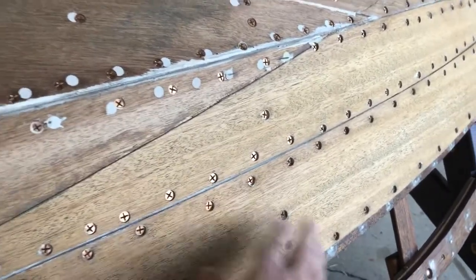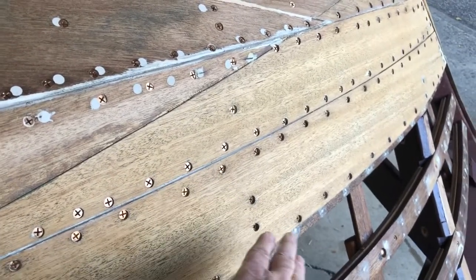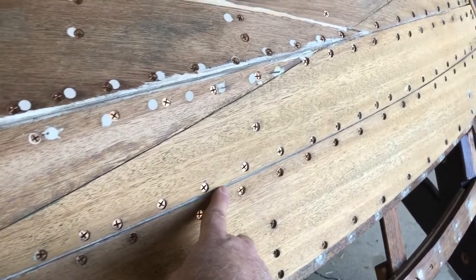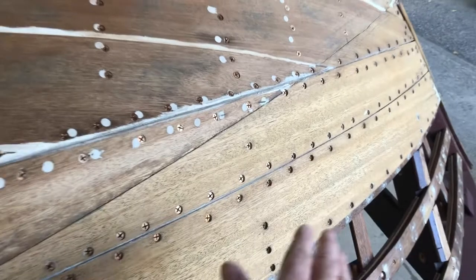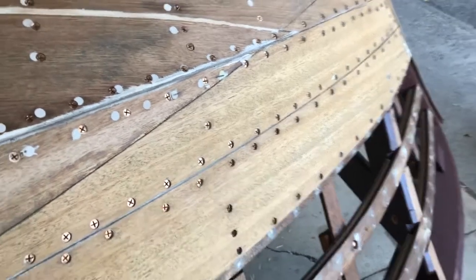For the bright side, ultimately I need to put the rest of the planks on, do some sanding, put the mahogany plugs in all the screw holes, and then bleaching, staining, and then the epoxy sealer before I do the varnish work.